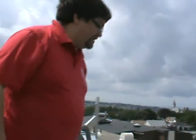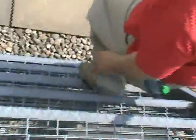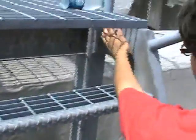The grading is great. If you can catch the steps from the top, Andre, you can see how steep these steps are. Right? It gives you very little room to step on this ladder, on the staircase. It's a little bit too steep. And if you come down here, you can see as well what we're talking about, relying on the weld. It's right here, perfect example is right here. Nice and tight, beautiful, the weld. But we need bolts here and here too.